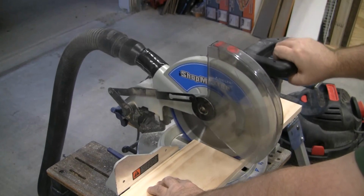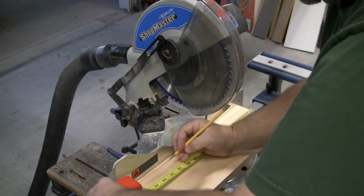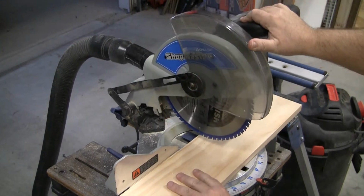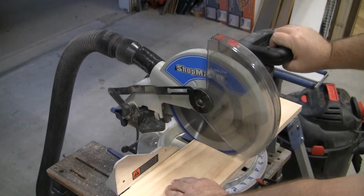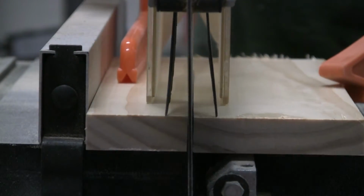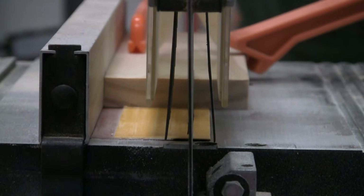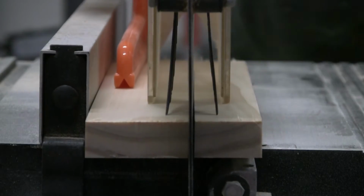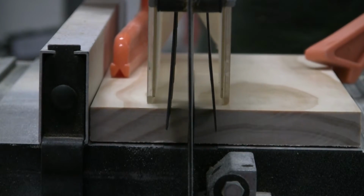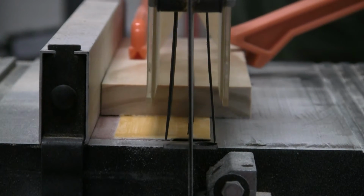After returning from Home Depot with a brand new shiny 1 by 6, I can now cut the boards for the top and bottom of the bulletin board frames. So I repeat the process of first cutting them to length, which is 11 3/8 inches, and then ripping them at 2 inches. Remember, I'm ripping 4 pieces. That way I can make both of my bulletin boards. If you're only making one, you only need 2 of these 11 3/8 by 2-inch boards.